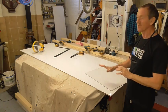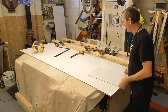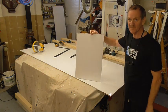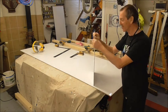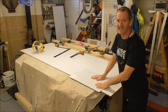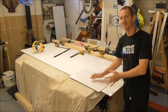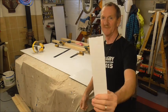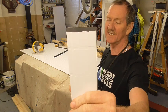Hello, now today on this project I'm working with a tile board. It's a Grant Westfield one. It's basically a Formica, but it's 3mm thick and it's pretty much double layered. So when it comes to cutting it, you can't cut it the way you cut conventional Formica by scoring a few times and cracking it. If you do that, that happens. Nice clean on one side, the other side's gone.